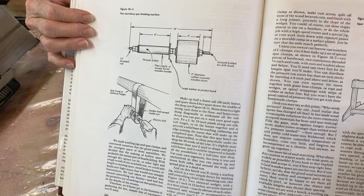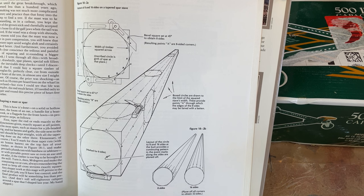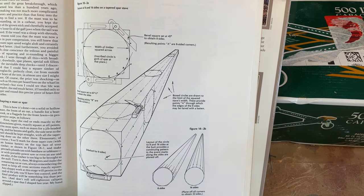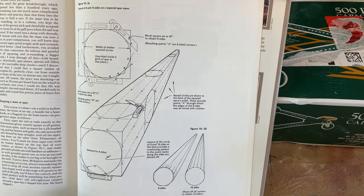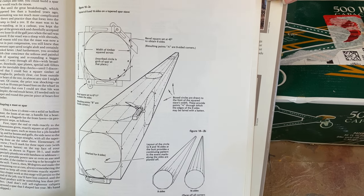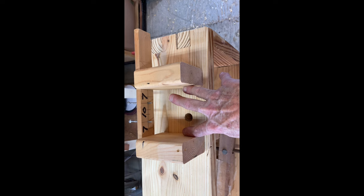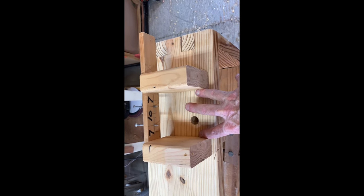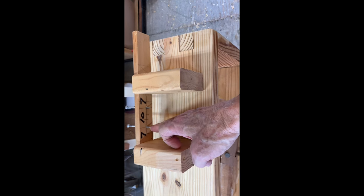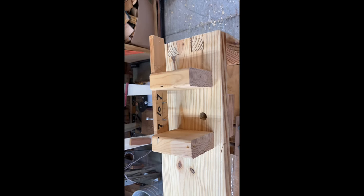This is how Bud described laying out a square piece of wood and marking it so you could take it down to eight-sided. We also had the marking gauge with seven units, ten units, and seven units. You can make this any width of whatever your square piece of wood is that you're starting with. Divide it into 24 units, put seven units to mark here, seven units over here, and ten in the middle — that'll give you your eight sides as you walk around and mark them.